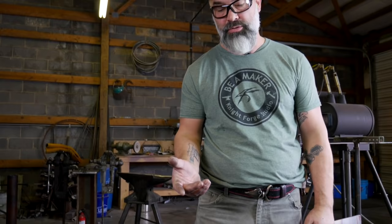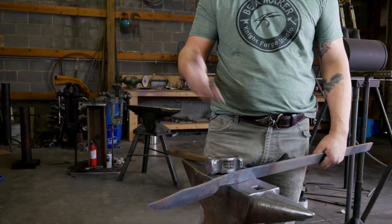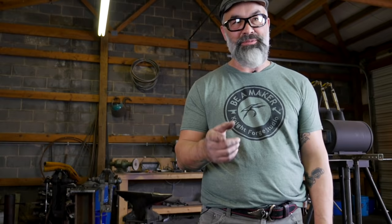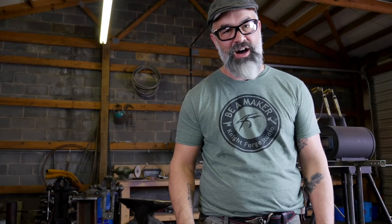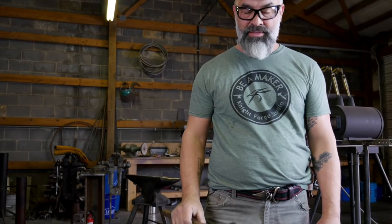What you can do next is cut your handle off — you're going to make a full tang or a hidden tang, that's totally up to you. In this case, this will be a full tang, so I'll cut it off at four and a half inches, flare it out a bit and taper it — very simple forging. Use the same techniques: half-on, half-off face blows. Even if you don't use a rounding hammer, that's fine — you can use a cross peen or a straight peen, they work great also. The peen is for moving steel dynamically; the flat side is for smoothing steel. I hope you guys enjoyed this video — subscribe, leave your comments, give it a thumbs up or thumbs down, tell me what you think. Have a great day.